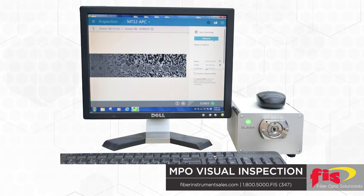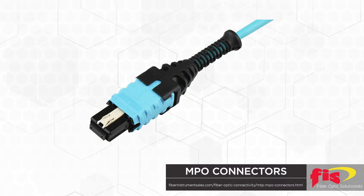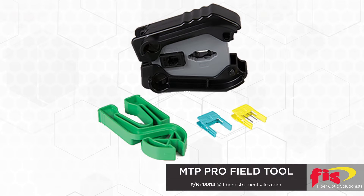Inspecting the geometric polished connectors calls for visual and interferometric test capabilities. Establishing proper fiber orientation of male and female connector positions was required. Style A, B, and C fiber locations within the ferrule positions had to be defined, and a special tool to convert male to female ends now exists.